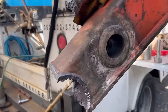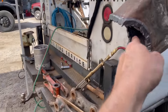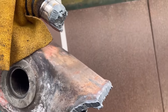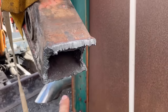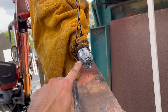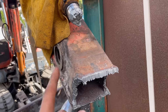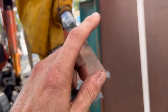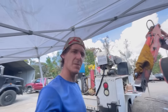We've got it beveled out. I might bevel it deeper through those welds, but I stopped there because that's kind of where the backing plate is — so I'm assuming that's where it was originally, and the previous guy just threw some extra passes along it. We're all beveled out now. I'll come back with the grinder, buff all this out, take our measurements, align our bushing, weld it in solid, and then get everything back together.